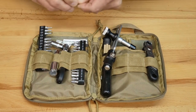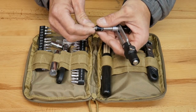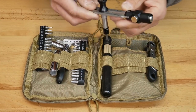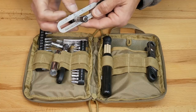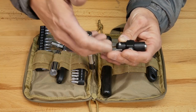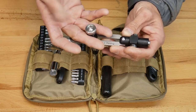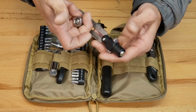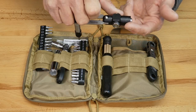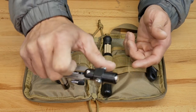So I'm going to put it right on 20. As soon as it touches, a quarter turn — that's it. Now what we would do is insert the bit we're using. Let's say we're using a one-eighth bit. You place this inside of here and it locks in. This will not come out until you pull back on this collar, so you don't have to worry about your bit staying in the piece you're trying to tighten. Right now we're at 20 inch pounds.